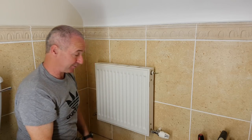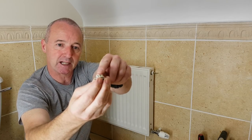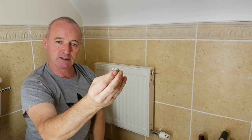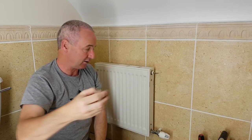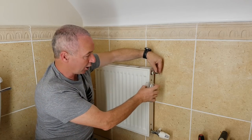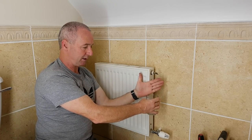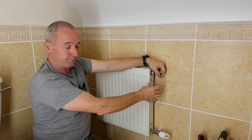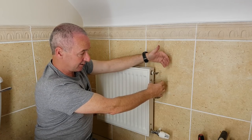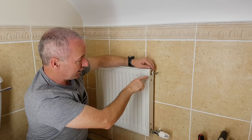This is the vent currently in the radiator. It's got a small hole and a plastic rotatable piece so you can direct the water or air out through that hole independently without moving the vent body. I'm going to turn it so it's pointing outward, get a glass ready, and open the vent. Be careful with these — if you put a spanner on the valve head, you could snap the plastic.